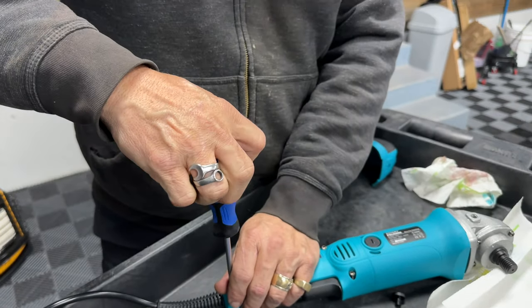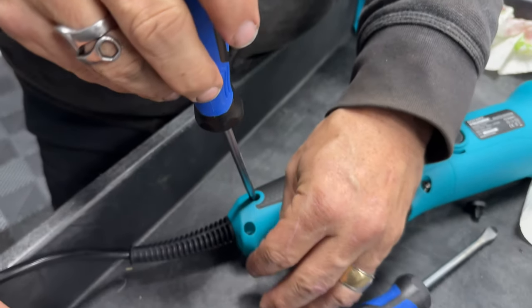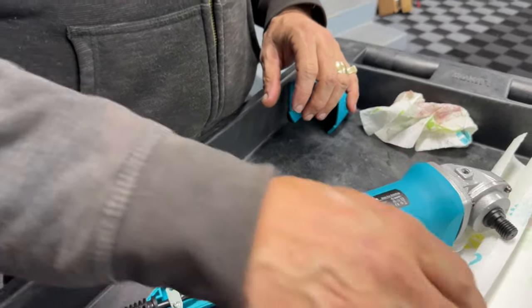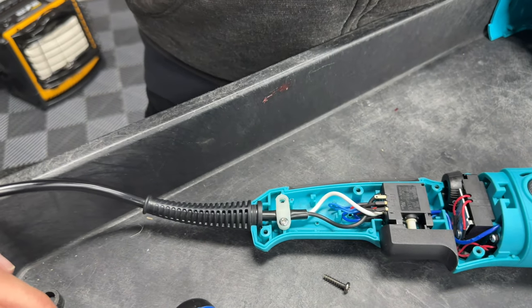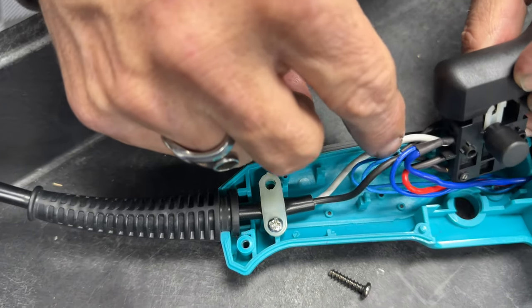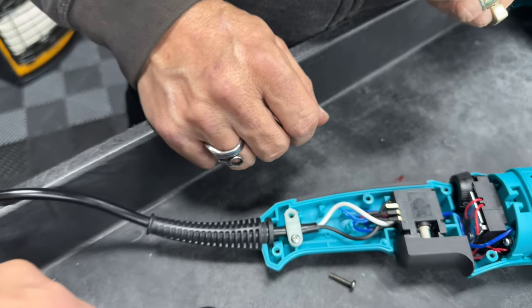In the shop we kept a 35-foot cord, because 35 feet is long enough to get around just about any car. Once we have the side cover off, we can see the cord clamp and the cord going into the switch. We're unplugged, of course. If the cord is loose enough that it can toggle the polisher on and off, just cut the cord shorter, strip the wires, and put them into the switch. There are two little screws holding the wires in — very simple.